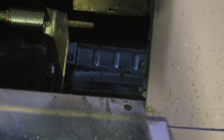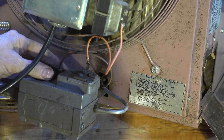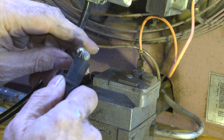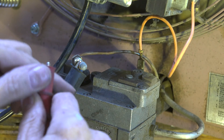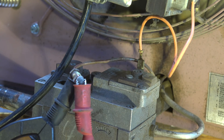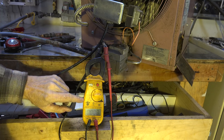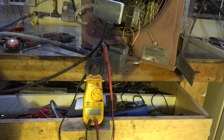What's going on? Here's where the thermocouple connects to the gas valve. I'm going to pull that off — there's the thermocouple right there. I'll set that up so I can test it: one wire on the copper tubing part and another one on the end button. I've got my multimeter here, going to set it to DC volts.